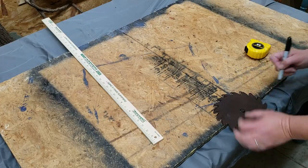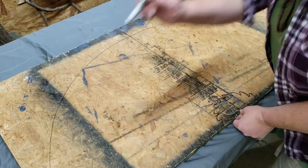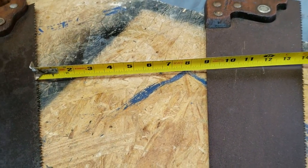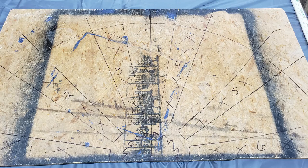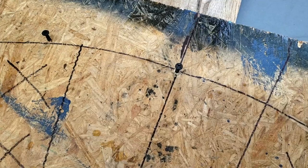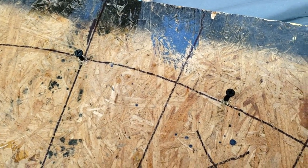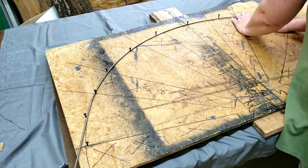Now the fun part. Like I said, I had no idea what I was doing. So I basically made the half circle and started spacing them out. They ended up being about 9 inches apart with the number that I used. I got a visual of it and kind of knew what I was looking at. Did the outline, and once I had the outline done, I needed to bend that rod. So what I did was screw some screws on the board, above and below the line, and that way I could easily bend that rod and put it in place.